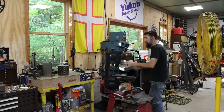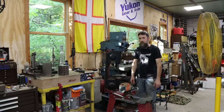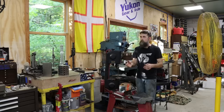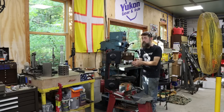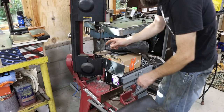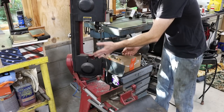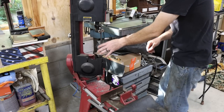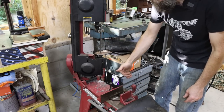I love my little Harbor Freight bandsaw - it's one of my most used pieces of equipment in the shop. If I want to cut something super quick and small, I go to this saw. It uses the least energy, it's lightweight, I can cut vertical or horizontal. About a year ago I picked up an accessory - a diamond blade for this saw. Lots of people sell them, so just look up 'diamond blade for Harbor Freight bandsaw' on Google and you'll find one to fit your model. Really neat, not crazy expensive. Super handy if you're doing ceramics, glass, or anything that's super hard.